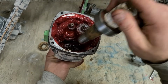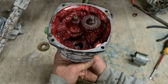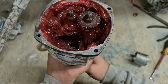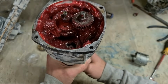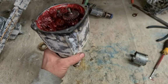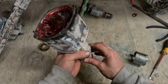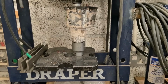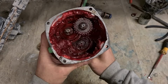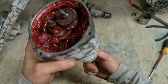So when you're pressing this on, the gear is going to be pressing that bottom bearing, and it's not overly tight anyway. As you can see, it slides up onto that bearing. So now all I need to do is press that gear, support the outside of this bearing, push it up on the outside race. Look at that. Not the standard method, but it works just fine.